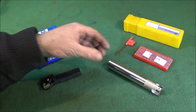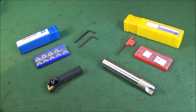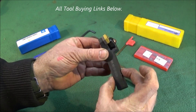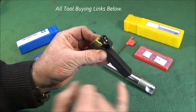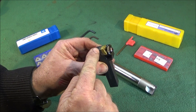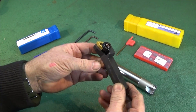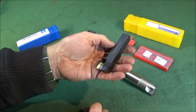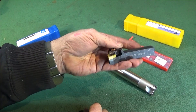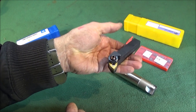Both these tools are super heavy-duty tools which in the past I've used on CNC machine tools. The first one is this 16mm shank turning tool — it's got a real heavy-duty carbide insert with six sides or edges, so it's a very economical tool to use. It can be used on cast iron and stainless steel, and it's very good with this super thick carbide insert for intermittent work.